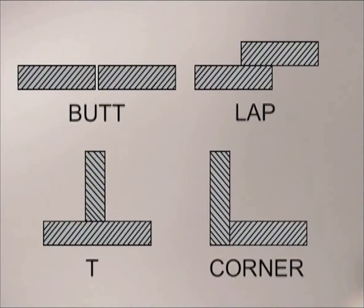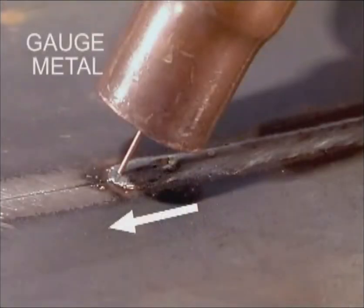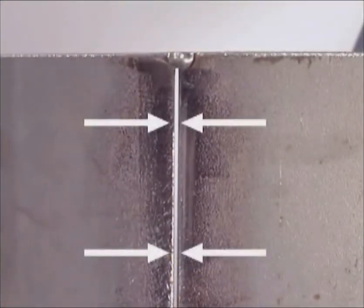There are four kinds of weld joints: butt joints, lap joints, T joints, and corner joints. Extremely thin gauge metal, like auto body metal, is generally lap welded, but if your project requires a butt weld, take the time to get a perfect fit. Any gaps will cause the edges to melt away, ripping open a hole. In a flat position, push the weld to help control penetration, but if at all possible, vertical down works best on thin gauge metals because the metal stays cooler. As the metal gets thicker, start leaving a little gap to allow for deeper welds. Keep it uniform though, so you can maintain a constant travel speed. A good fit up makes it easier to produce both a good looking and strong weld joint.